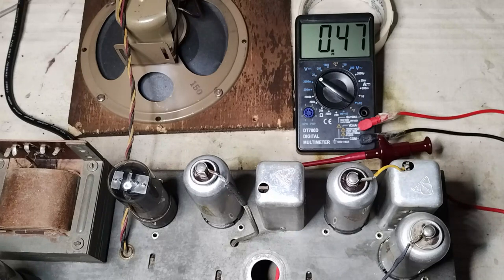At the time in which this radio was made, in Europe there was no standard for the frequency to use in the IF chain. As there is no documentation about the radio, and the same is for most of the other French radios of that time, it is impossible even to make a guess. Using a signal generator, it is found to what intermediate frequency the radio appears to be somehow peaked. The frequency found is 473 kHz, and the same is used for repeating the alignment.